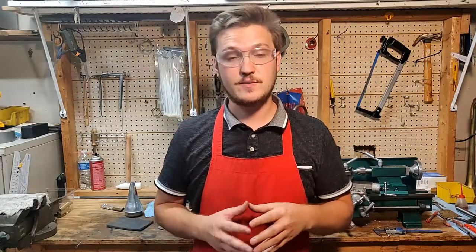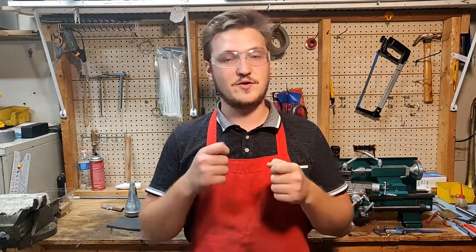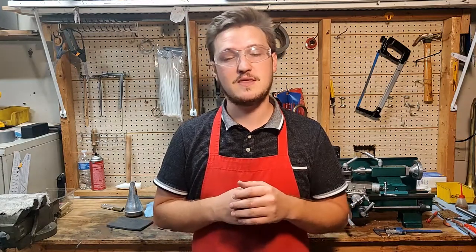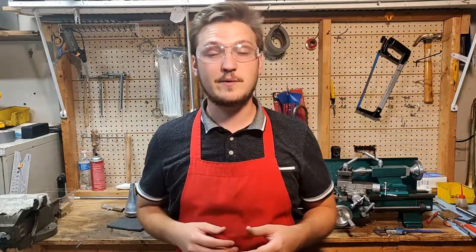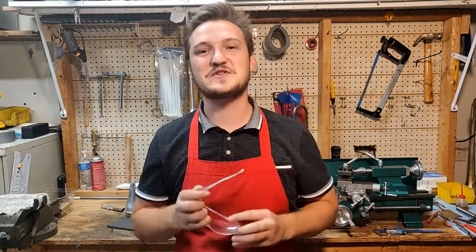So that's how I made that mandrel. While I was trying to hit a very specific dimension I didn't feel comfortable hitting that one dimension with the tools from the lathe, so I approached it with some sandpaper to really get it into the slip fit that I wanted for that part. Anyway, if you want to be notified when I post more videos make sure to subscribe and hit the bell icon. Thanks for stopping by the shop!